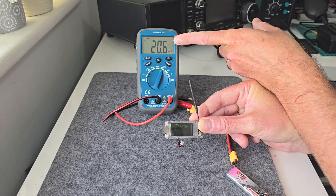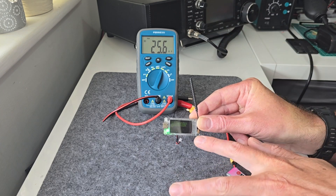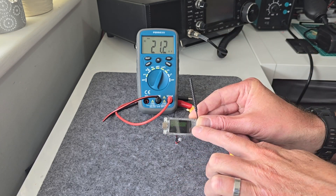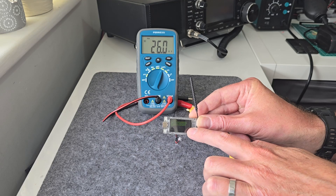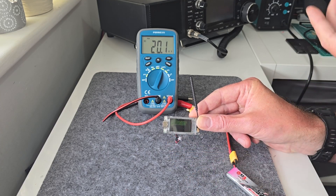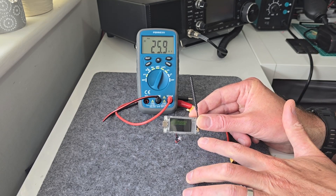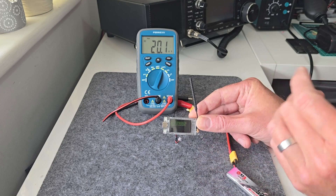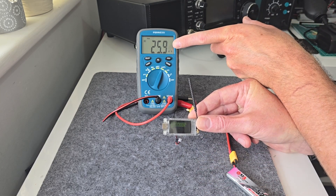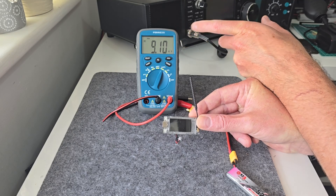There you go — 186 milliamps on transmit. It does that so briefly. Now obviously we've got the screen on at the moment. There's another beacon there so you've got the screen on here with the LED backlight. This little flashing LED probably isn't taking a huge amount, but there's generally some stuff going on. There's a message been received and everything else.